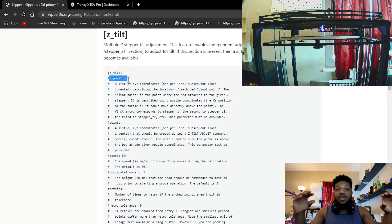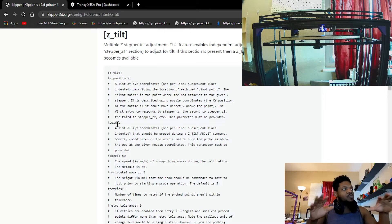Now those two points will be a pivoting point — that's where most of the pivot is gonna happen. The more you move in, the less the pivot is; the more you move out, the more the pivot is. So that's your pivoting point. Now, where it says 'points' here — your X and Y coordinate points — you're gonna move in just a little bit. I'm moving about 20 millimeters on each point, sometimes a little bit more just to keep the symmetry. It's gonna calculate all of that together, because that's what you're putting into the firmware. So once you find those points, you plug them in, and that's what it's gonna use as its coordinates to do the Z-Tilt adjustment.